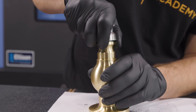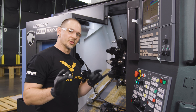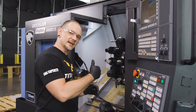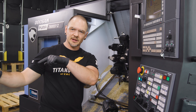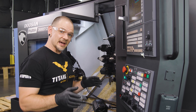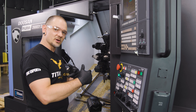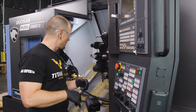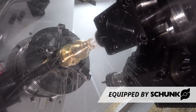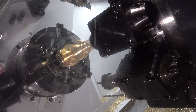She's a tight fit, but plus or minus two tenths usually is. Now we've got to put a 3/8-16 thread inside of here that'll match the thread on our Vero S foot or peg. This is a live tool lathe, so I have a couple of options — I can single point cut this thread, or since I have the milling option I can thread mill it, and that's what I'm going to do. I have a thread mill by Kennametal with 15 teeth, so that's going to allow me to thread mill this a lot faster than I can single point it.